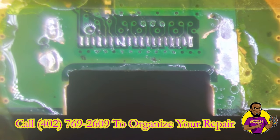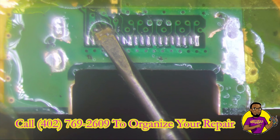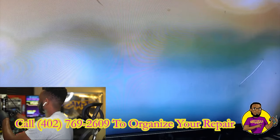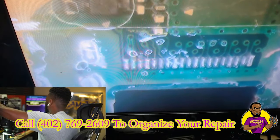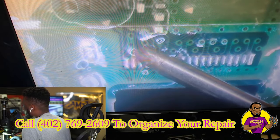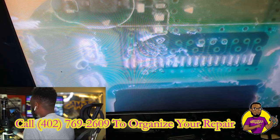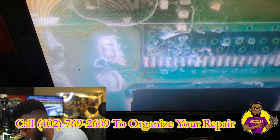All of this is just completely horrible, so we're going to have to redo this entire header and get new solder on everything. I switched the microscope to display on my TV to get a better view. The component that's supposed to be there is obviously gone. Looks like whoever worked on it previously bridged what was there instead of putting a new component from a donor motherboard. That's something we're going to have to do before we even put on the new HDMI port — I'm going to have to put on a new component.